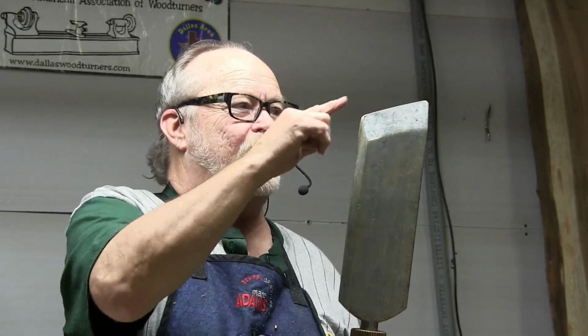Okay. I got a newsletter from a California group. They said the secret to the skew is grind off the points. You just wiped out 7 of my favorite cuts. I think there's some confusion about that. No, a straight across chisel is a wicked tool to use. You're going to get more runbacks and dig-ins both. And I'll explain what both of those phenomena are.